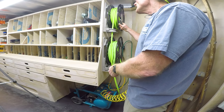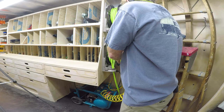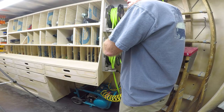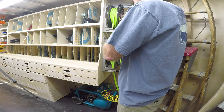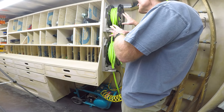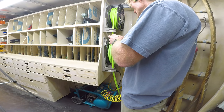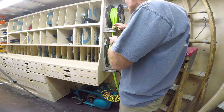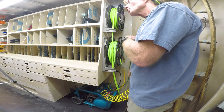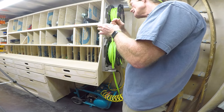For the electrical, the end that I plug into is the last to go on. I create a little pigtail and zip tie it right on so it hangs out about six inches. When I'm rolling it up — whether it's the electric or the air — that little pigtail is there, doesn't get in my way, and stays put with the zip tie zipped right onto one of the spokes of the wheel. I've routed both the air and the electrical through the guide on this reel, and I've drilled about a 2.5-inch hole in the floor just big enough to get the fittings through.